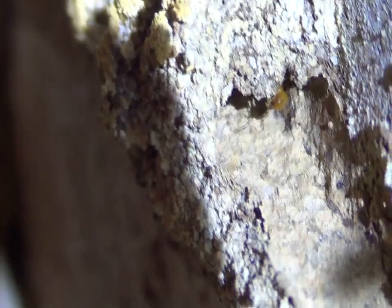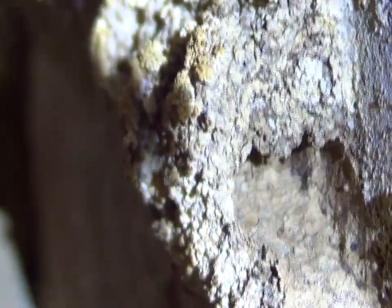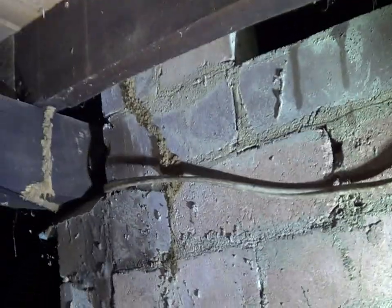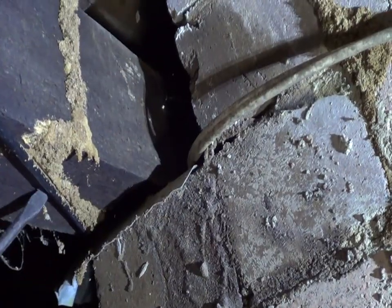This soldier wants to scare me away, so he acts defensively. When you are in the subfloor, what you are looking for is the mud trails of termites, as you can see here — mud trails going up. And this is the ant capping, the metal shield. It looks like termites were able to bypass that and get inside.